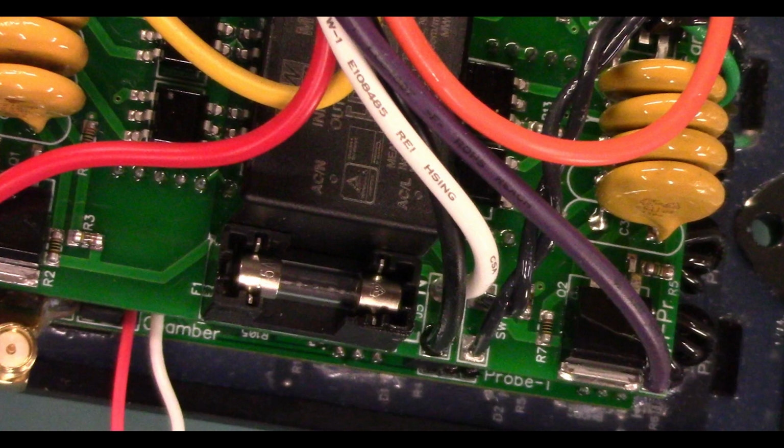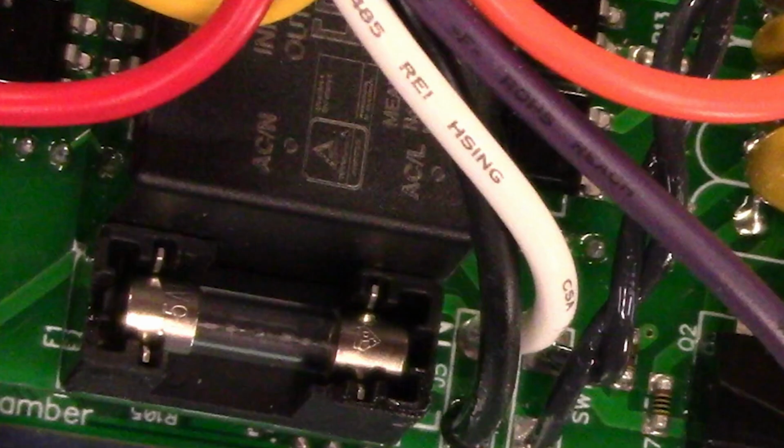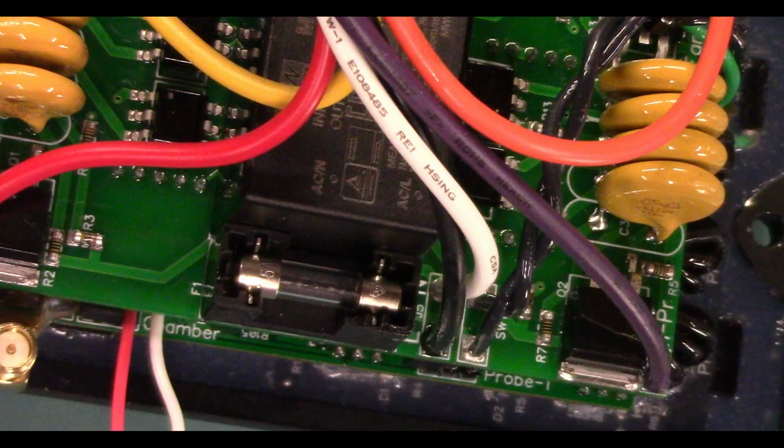What is happening in the Muxall Pro BBQ Controller when an igniter, fan, or auger shorts out or a motor locks up, that's bad enough to blow the fuse, it sometimes, but not all the time, but sometimes damages the connecting triac.